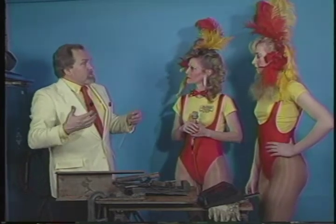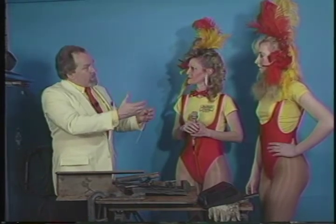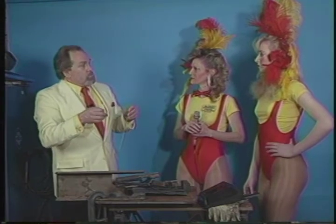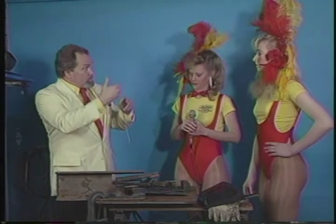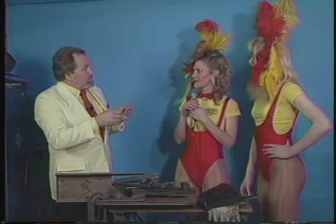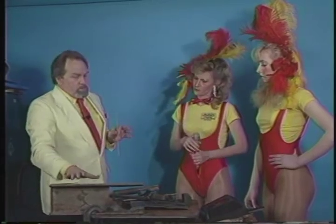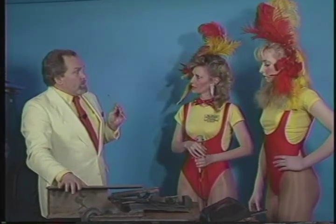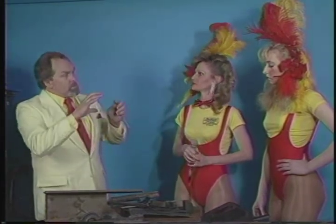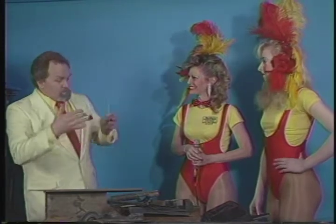And for a person that's inexperienced, it's startling. They don't realize what's happening. Where the oxyacetylene, it slows everything down. It gives you an opportunity to see how metal behaves as it enters its molten state. As you add filler rod, how it behaves, that it cools. You can actually see the heat, which I think is helpful. So when you go into this, yeah, this is real handy and quick and all that, but I really think you handicap yourself if all you learn is this and you never learn that, and then you don't see how metal behaves. And again, trust me, you really should do oxyacetylene first, then move on to this.